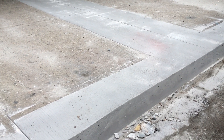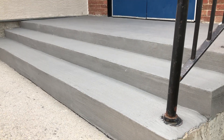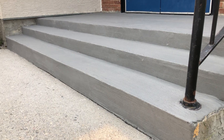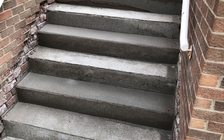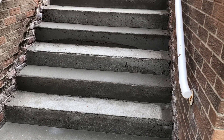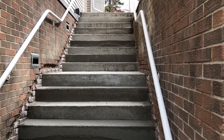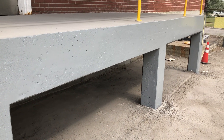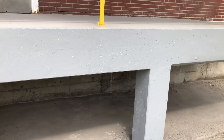And here are just some images of these finished products — this is what you're able to do once you properly prep the concrete. You can apply the TF structural restoration methodologies, and we have lots of videos showing you different ways to do stairs, forming, rebuilding, overlays, skim coats — a whole number of options. So you do not have to rip out and replace every damaged concrete structure you find. Most of them are going to be eligible for a restoration that will last for years to come.